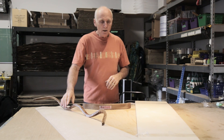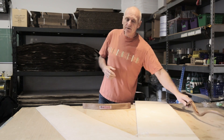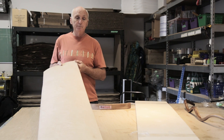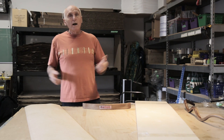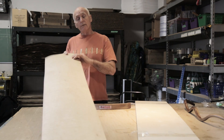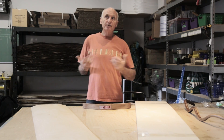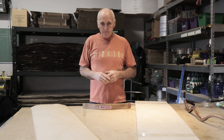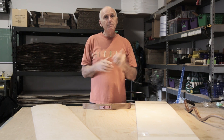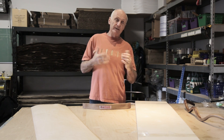When you do pressings with thinner materials, a great example is a sixteenth of an inch maple veneer — if you were laminating something that was one inch thick, you would have 16 layers of this material, which means 15 glue lines. 15 glue lines is substantial, and a three-dimensional shape laminated with 15 glue lines will be hard pressed to actually pull back to flat.